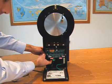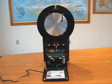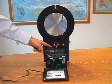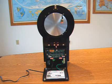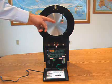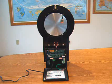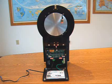And I will engage the power switch. The lights will blink in unison as the system powers up and establishes the inductive link. Once established, the main status indicator will remain lit on solid, indicating proper power and data transmission between the rotating and stationary units. The LED on the pre-wired star bridge should also be lit, indicating proper gauge power supply from the Revolution transmitter. I'll now power down the system and trim the gauge lead wires and solder them to the strain gauge.